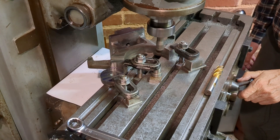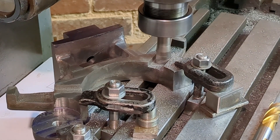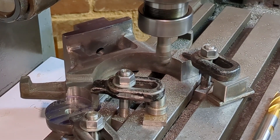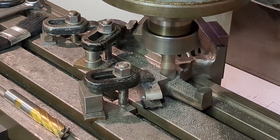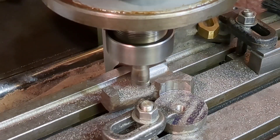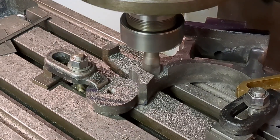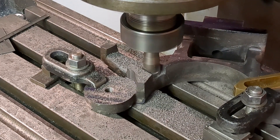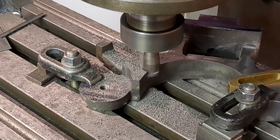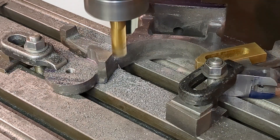The base casting is slightly more complicated because there are two fingers and because they're at an angle, but I found it reasonably easy to set up and it was actually much quicker than I thought. So much the same process - I'm going to do one finger and then rotate the casting and then do the other finger following exactly the same procedure. I really am impressed with these castings which I have produced in Pakistan. They are good quality, easy to machine, no hard spots and very few indications that the mould hasn't been filled thoroughly.